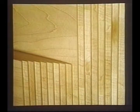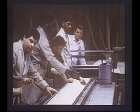Straight-grained hard rock maple is laminated and glued together in flat-grain sets. The number of laminations per set needed for the rim varies by the model, with the Model D Concert Grand having 18. But in all rims, the flat graining gives a 47% improvement of vibrational characteristics over cross-grained plywood-style sets.